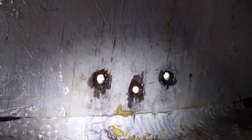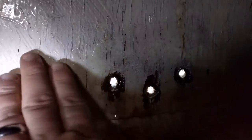I've got the gudgeon removed - this is from the interior side. I filled these holes in with epoxy and then put a base layer of epoxy extending up to about here. You might be able to see it. What I'm going to do now is re-drill through these holes.